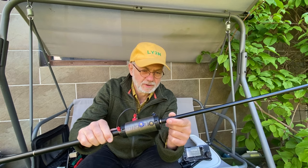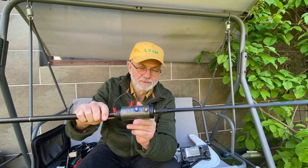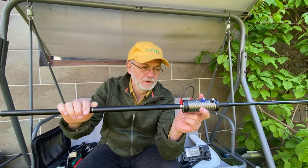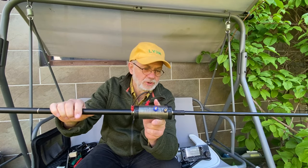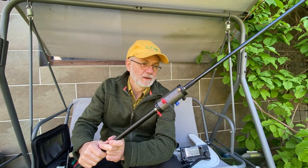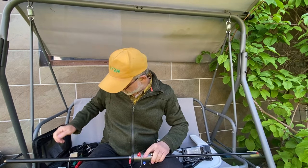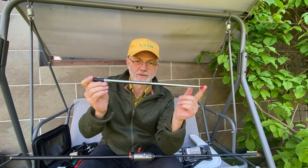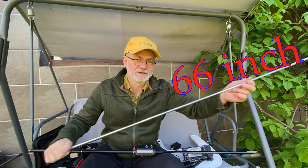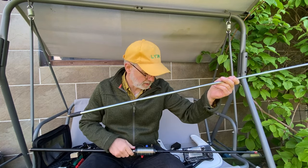It protects your antenna from cracking in this place after being a couple of times or many times in the wind, especially if you mount it in the dipole configuration, two Buddisticks in a dipole, or just the Buddistick somewhere on the balcony like this. There's some angle, so there is a strain here. Originally, when you buy the kit, you get this shorty whip. When extended, it makes 1 meter 68 centimeters, so it's almost twice as short as the long one.